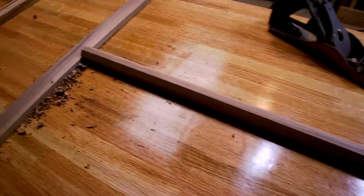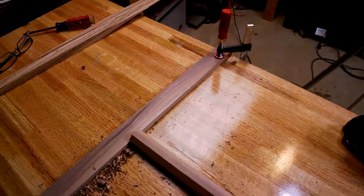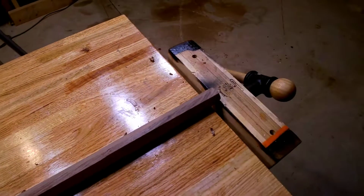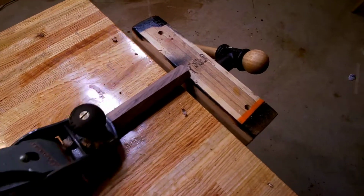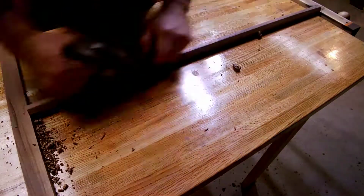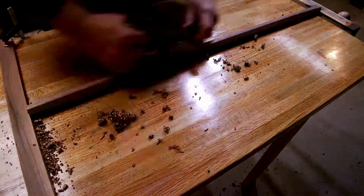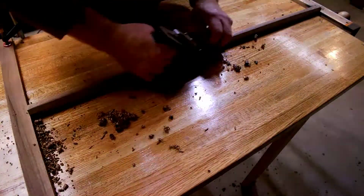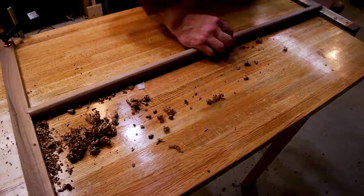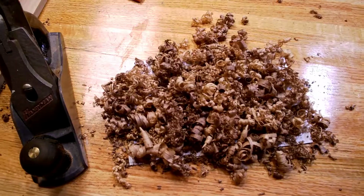So without the lathe, I've got to do some hand tooling on this, and one of the things that I wind up using my little tiny workbench for is I'll block it like I've done here on one end of my bench, and then my bench vise is actually set up to be about 1/2 inch higher than the height of my tabletop, and that allows me to clamp pieces in like this and to work the wood with hand tools. So what I did is then for each one of those edges on the 45s, I actually went in with a hand plane and I just started to take those edges off. It's not going to be completely round when I'm done with it, but it's going to take a lot of that material out of there. When you look at it from a distance, when I was done with this process, it actually looked pretty round. And it actually made nice piles of shavings.